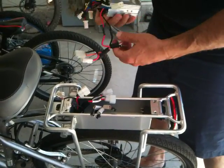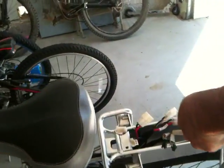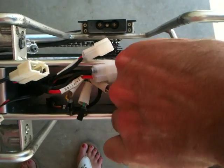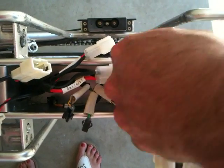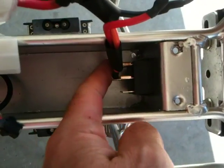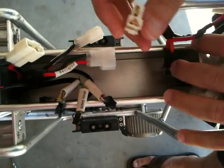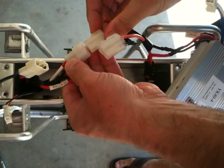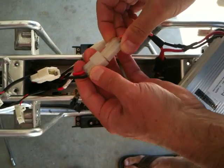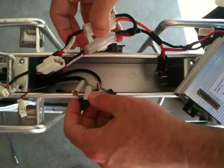All you have to do is this here needs to connect to the switch. So I put it on right here — you can see those are connected onto the switch. Now those two sides will allow switch position one to engage. And then here, battery one and battery two — you put one on battery one, one on battery two. The magic of this little thing is that it takes the two batteries and wires them in series into 48 volts.